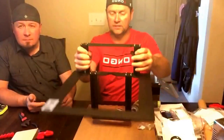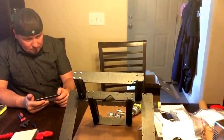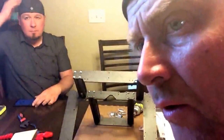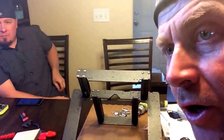I gotta look at what he just said. I guess I could pull it up on my phone. You got your phone here, don't you? Yeah. When you heat up the nozzle, push filament so you can see flow come out and then wait for a little cool, a few degrees, before pulling out. Okay. Your logo is reversed.